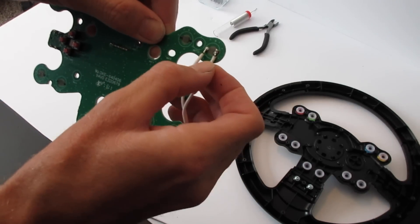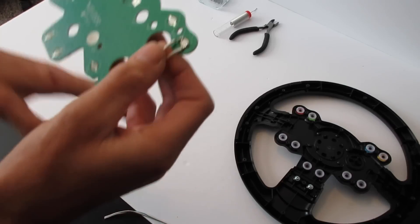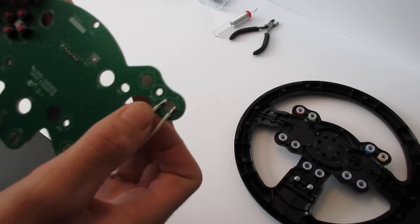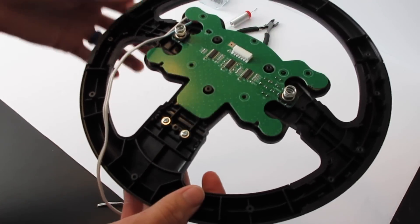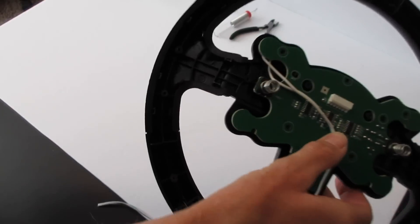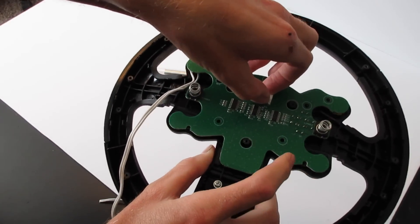Check it — wiggle it around and make sure both solder joints will stick. Look at the fingers to make sure there's no solder bridging to the opposite side fingers. It looks good. At this point you can put some hot glue on the wires so there's less vibration and less chance of them coming off. However, if you still want the B button to work on your steering wheel, you don't want extra hot glue because it'll make the button feel squishy and it won't have the same audible click.